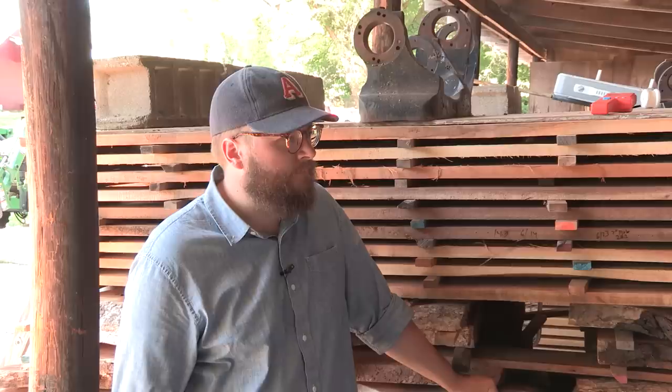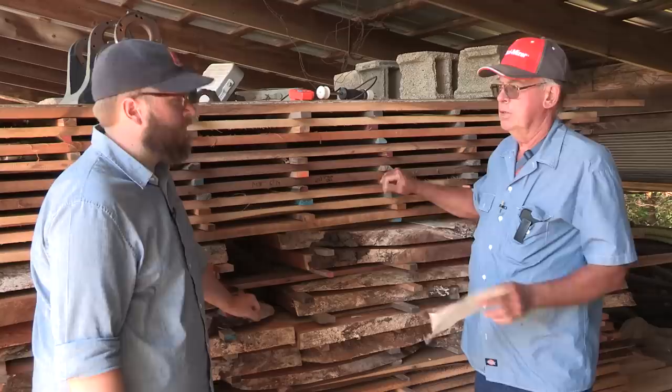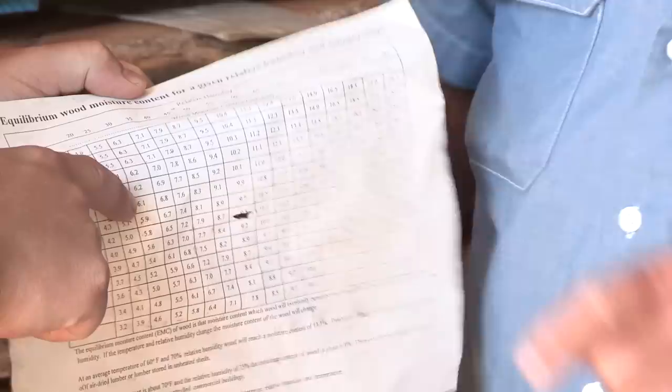These are past ready — they'll go in the kiln and I'll try to get them down to about 7 percent moisture content. The thing to remember is that even once you get it down to 7 percent, it has to stay at a certain temperature and relative humidity to stay there. If I dry this lumber in the kiln and stick it back outside, it'll be right back up to 12 percent. At about 70 to 78 degrees and 35 percent relative humidity, you're at roughly 7 percent moisture content — that's where kiln-dried lumber should be kept. You're trying to get that wood at the average moisture content it's going to be in service at.